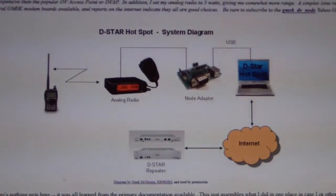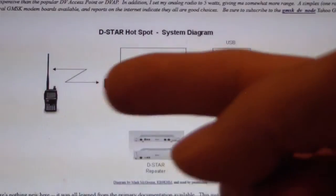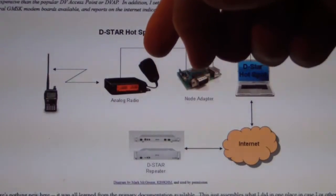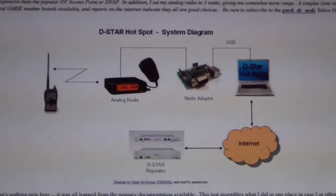As you can imagine, hooking this up to a 50-watt analog radio — I've got a couple of spare ones sitting around — is going to give me a lot greater coverage than 10 milliwatts, regardless of how high I get the antenna. So what this setup is effectively going to let me do is talk in through my ID-91AD D-Star HT, into the analog radio, which in this case is either going to be the Kenwood V71, or I'm also considering possibly using the Yaesu FT8900, which is currently in the car.